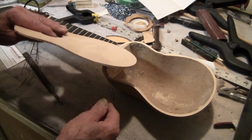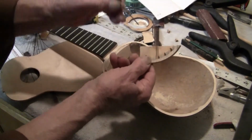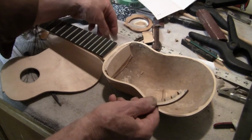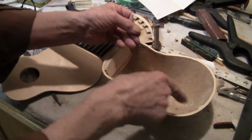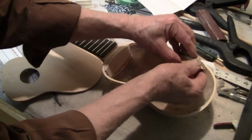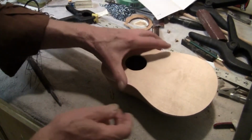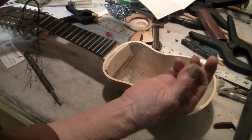And it failed. And the bracing was, here's a piece of one of the braces. The brace is just like a diamond shape that didn't have length and structural integrity. Kerfing, a lot of kerfing all the way around. These were triangles, but the bandsaw cut through them. This top will have no kerfing. The glues that we have are just good enough. There's a lot of surface area here. It's not 16th of an inch mahogany.